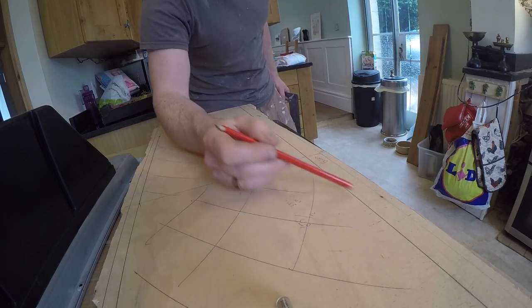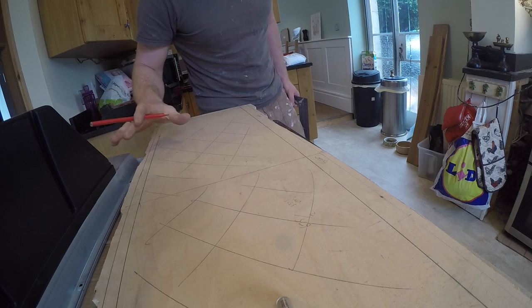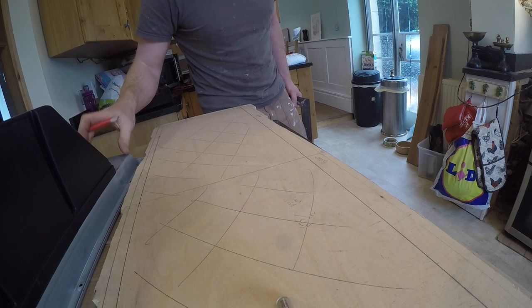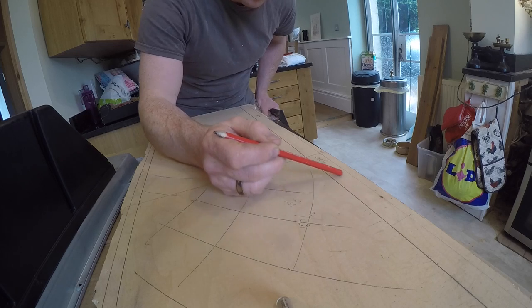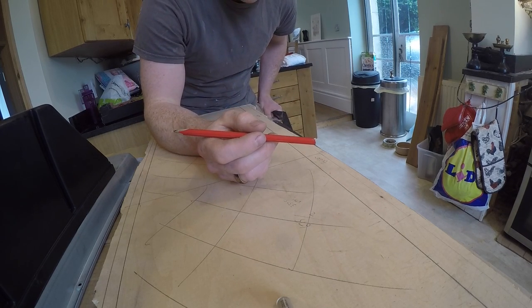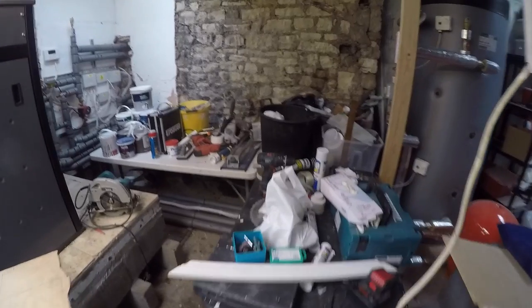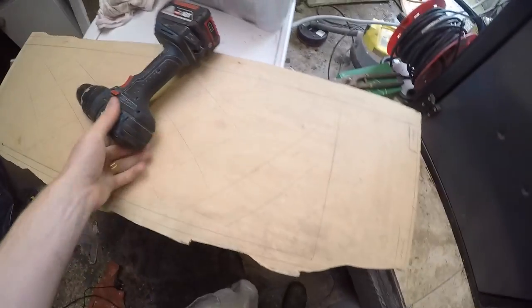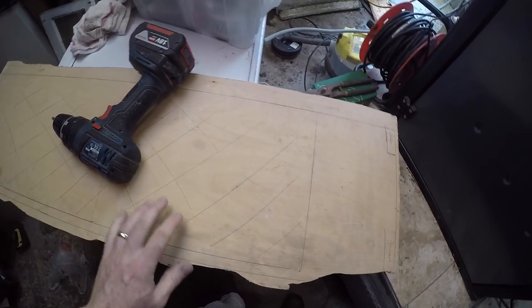Next thing to do is to do the cutout itself. So we've got our opening. I can check that out here, it's much easier. Slot it over to make sure the actual extractor fits in. And then I'll put the 1-inch batten onto the plywood and I'll screw that in. And then we can try and line it up and get it fixed to the wall. So my temporary little workshop is out here where the boiler's gone in. And as you can see, it's just a state. Anyway, we'll get a hole drill to start with, and then we'll jigsaw out that piece and go from there.